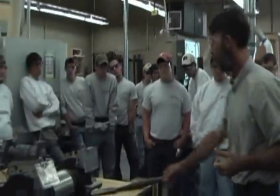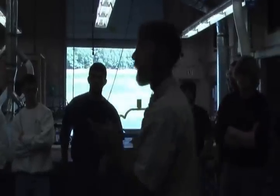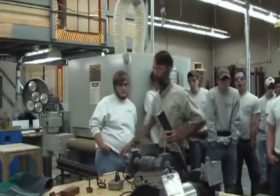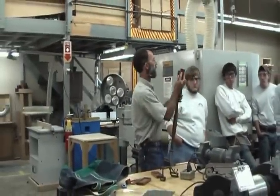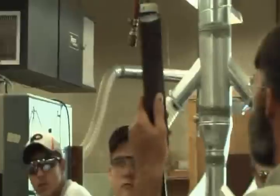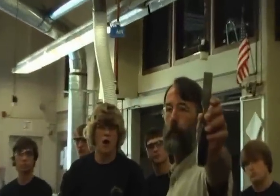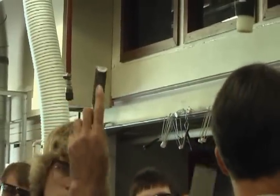Alright? The way we do it, I will always stone, actually I'm going to cut myself, I will always stone the back of my chisel. Something this big, I can actually take the stone and do that. And you can see on mine, that shiny area is from stoning. That's all it is. You get a finer stone, you can get a high enough shine, you can see yourself. You get all your chisels sharpened at some point, and you can see these have been done as well. Shine your area toward that cutting edge.